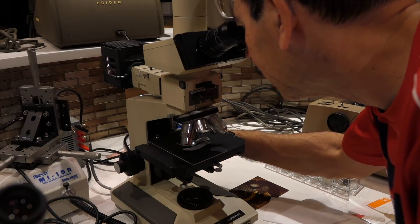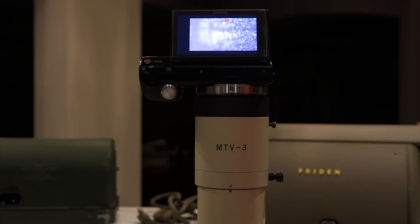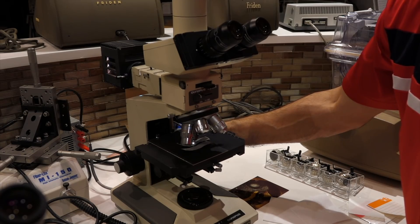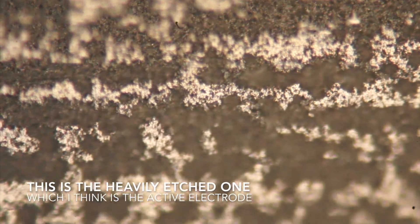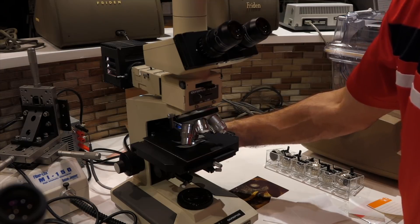The other one is a lot smoother — although it appears slightly pitted, it doesn't have that large three-dimensional structure. The idea is that you would etch the surface to increase the surface area and oxidize it, and that's the oxide on that large surface area that gives you the large capacitance.